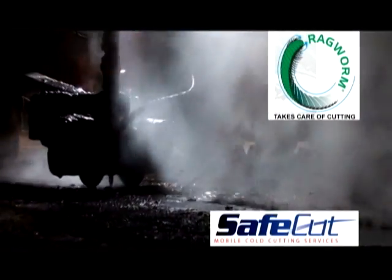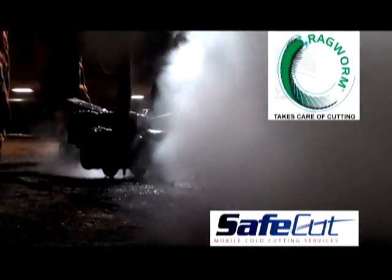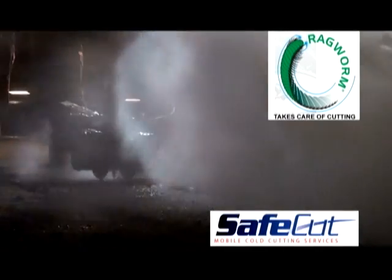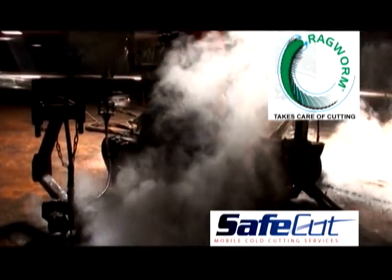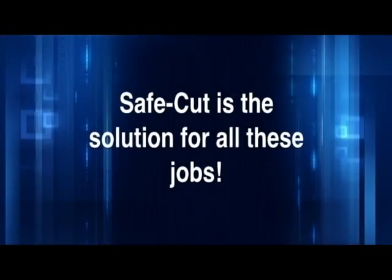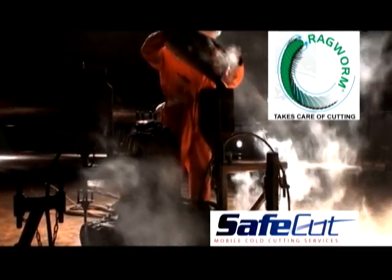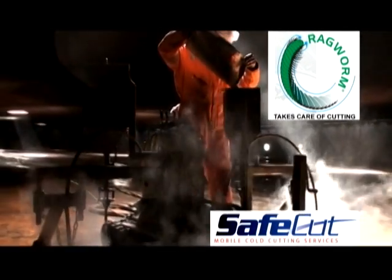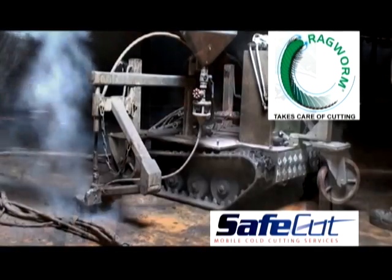In the past, extraordinary methods and efforts were required to cut the floors out of tanks where the tank had been previously lined with fiberglass or epoxy coatings, had been repaired by installing a second or even third layer of bottom plate, or had leaked with liquid product or product-saturated soil under the tank bottom. SafeCut is the solution for all these jobs. In one pass, the system cuts through both tank coatings and the bottom plate, or through two or more floor sections, resolving the fire and smoke production issue.